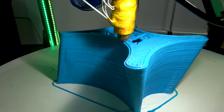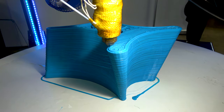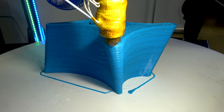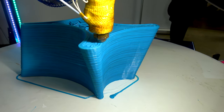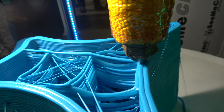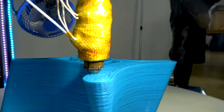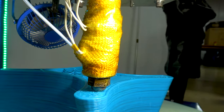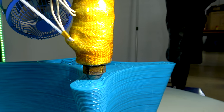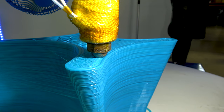If you're familiar with 3D printing, you're probably used to a 0.4 millimeter diameter nozzle. This actually has a 4 millimeter diameter nozzle — it's huge. You can see the layer striations are massive, but when you're printing stuff this large, it actually looks very cool. The hot end on this thing uses about 700 watts. You can see all of the wires going in there to deliver that 700 watts and the insulation needed to melt the PLA and deposit it at that speed and density.